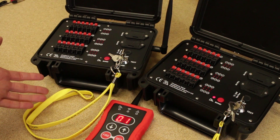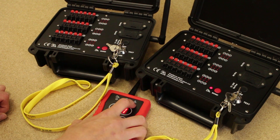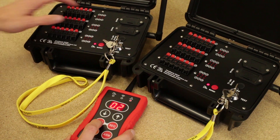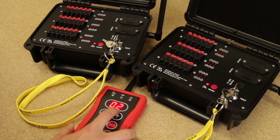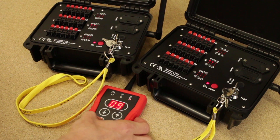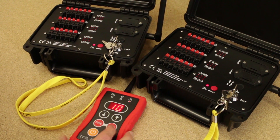What this means is that they're both going to fire in parallel. If I were to arm them now — I've pressed the arm button on the remote and we've got our arm light — solid red lights here. Press the fire button and you'll see cue 1 is firing. Fire cue 2, and it fires at the same time. As fast as I can tap the fire button, you can fire cues, and obviously I can also fire sequences in parallel as well.